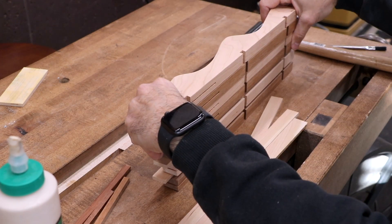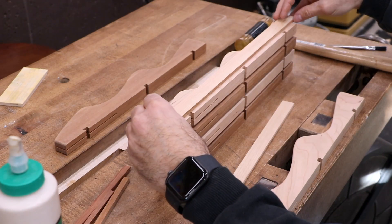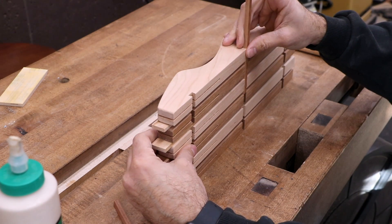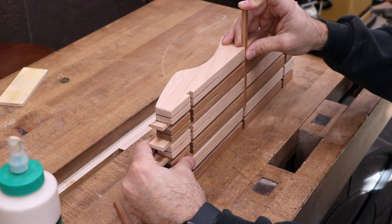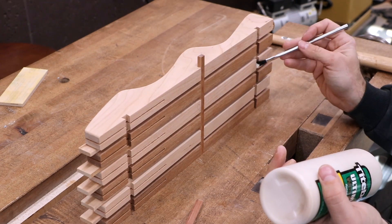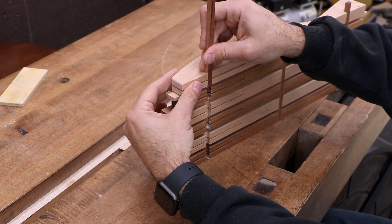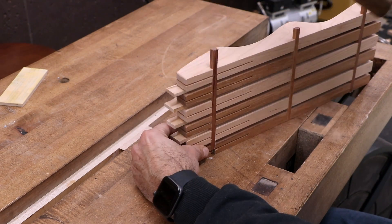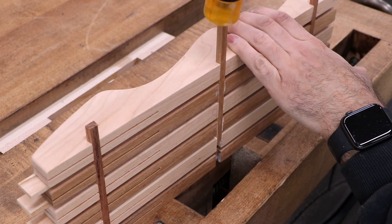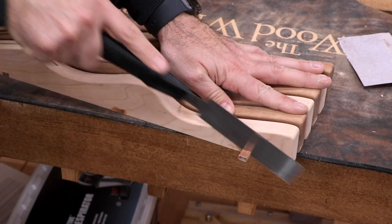To do the glue up, I'll use small spacers between each rib. As simple as this project is, the glue up can get pretty hairy. Water-based glue causes wood to swell, so a sliding dovetail that fits perfectly when dry may never go together when coated in glue, so I'll work quickly and use the glue sparingly. I'll insert the center dovetail key into the slot just to keep the pieces aligned. Now with glue in the outer slots, I can tap the outer keys in place. Once those are installed, I can insert the center key with glue. Once the glue dries, I can use a flush trim saw to cut off the ends and sand everything nice and smooth.